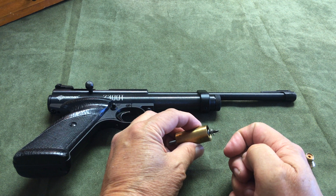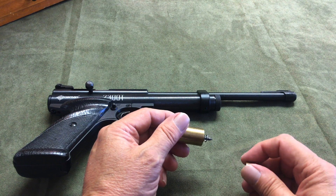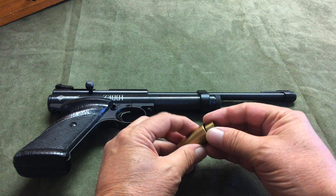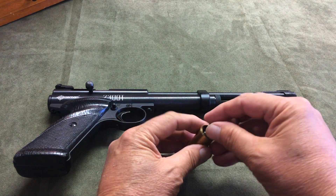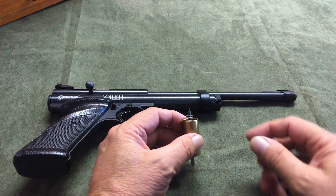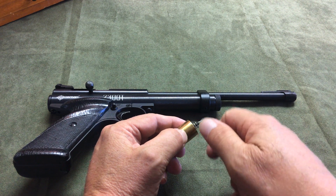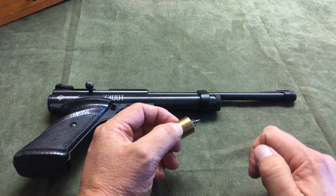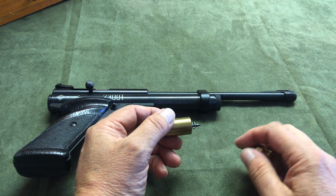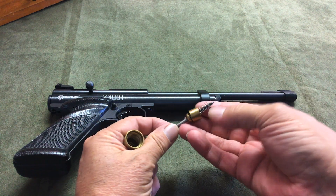This is a standard valve at standard volume — if you take apart a 2240 or one of the other pistols, this is what you'll see. However, in one of the target pistols, you'll have this additional piece that's been added. They go ahead and slip it down inside there. What that does is it reduces the volume, reduces the gas capacity of the pistol such that it doesn't fill with as much, and each time it fires, it doesn't release as much CO2. The effect is a slight reduction in velocity but an increased number of shots. That's one of the differences between the target pistols and a standard Crosman CO2 pistol — the addition of that spacer.